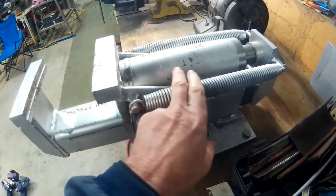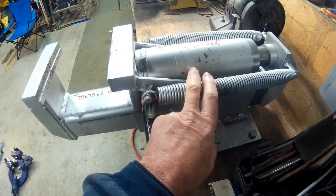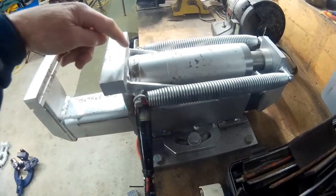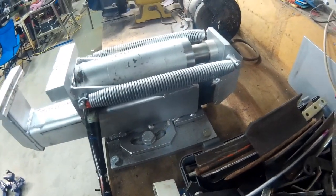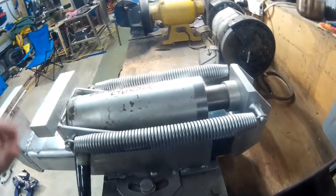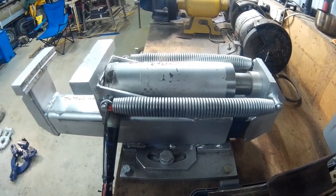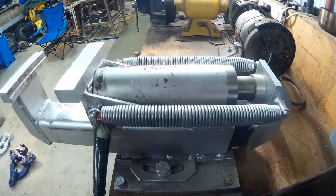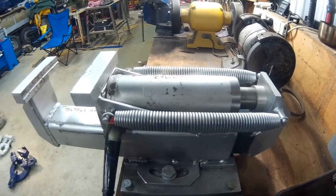This hydraulic cylinder was made out of a leftover piece of hydraulic cylinder tubing that came off my tractor. The tube had some rust in one end, so I had to replace the tube for the tractor cylinder. I just cut this bit off — which didn't have rust in it — put a new end on it with a connection in there, and I had to put a circlip in there to stop it popping out this end. I made a piston that goes inside, which I can't really show you. The piston just uses an ordinary O-ring seal and it's made out of a piece of aluminium I had lying around. Surprisingly, with just an O-ring, it works perfectly — it doesn't leak at all. So you don't need to buy sophisticated, expensive hydraulic seals for jobs where it's just moving occasionally.